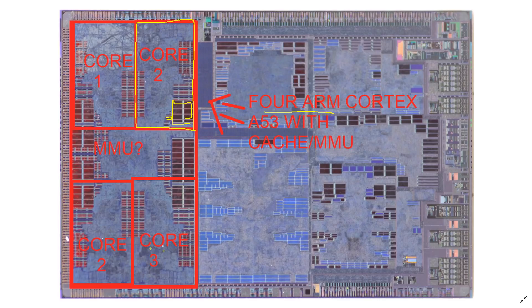There are definitely four cores, and then in the center there's a coordination function. As all these cores operate, they have to have a way of accessing common resources - you need something to arbitrate between them. You also need a cache, and I believe this center block is just that. These processors can coordinate their actions, because when you start coding embedded firmware with multiple cores, you need some way of coordination. Of course, looking at this, you might think the Raspberry Pi is all about Cortex ARM cores, but it seems like a huge part of the chip actually isn't a processor.